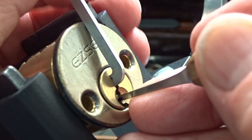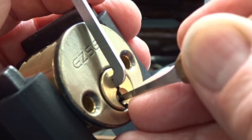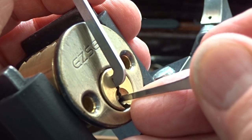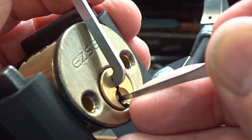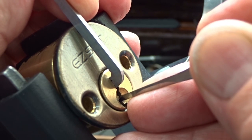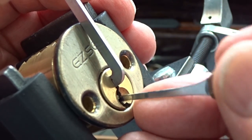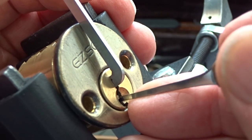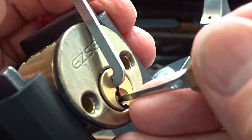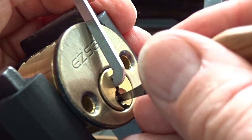Getting counter rotation on three — got a click on him and got the false set back. Getting counter rotation on four but I'm not going to go for it because it's just slight and I might just be pinching the core, can't tell. There we go — more counter rotation, looks like pin one. I want to release a little bit — he's apparently got a nice sharp groove in him. I lost the false set — no, I got it back. More counter rotation on one — one click — I lost the false set. Back to our false set, so two definite grooves on him. Another click and he turned a little bit further; very slight counter rotation on three.